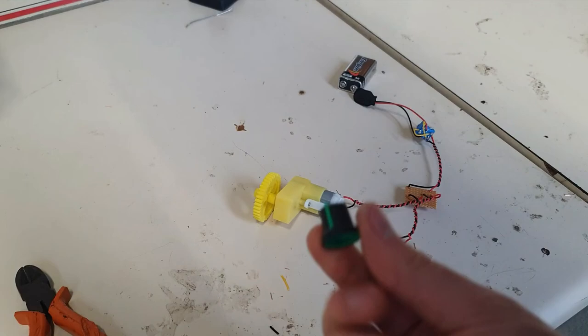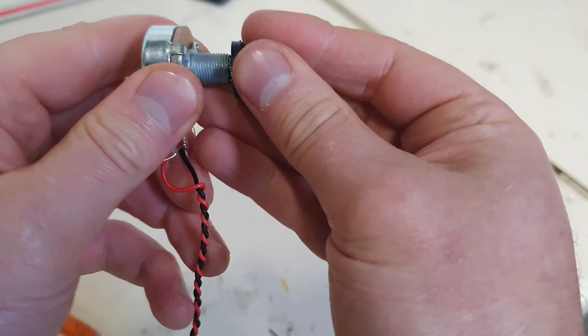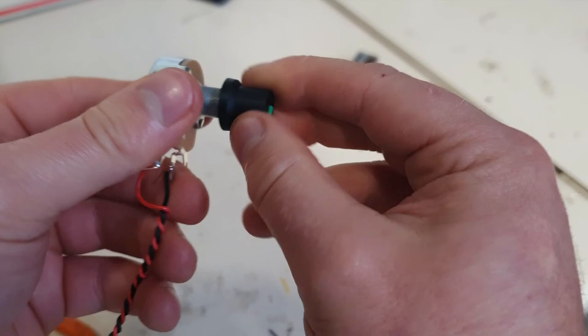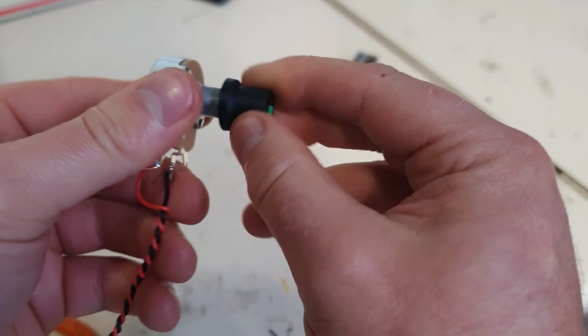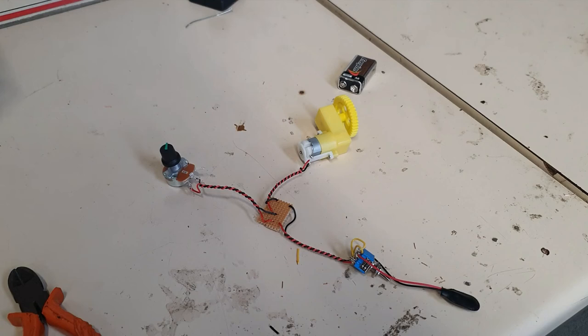Something that's really nice on a project — see this hole here, it's around eight or nine millimeters, so you can drill a hole for that and get a nut to screw it in. If you get one of these caps, that looks really nice — you can get different colors to match your project, and that just adds a nice little touch. So that's adding speed control to the double pole double throw center-off switch. It's asked for quite a lot in a project, and even if it's not asked for it can be a nice addition — it's just one more component and a little bit more soldering. Hope that helps, thank you for watching everybody, and see you all in the next video.